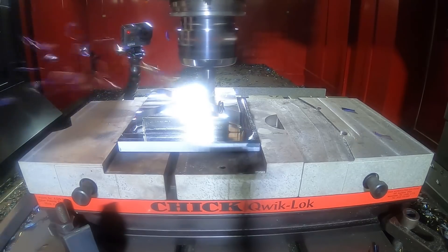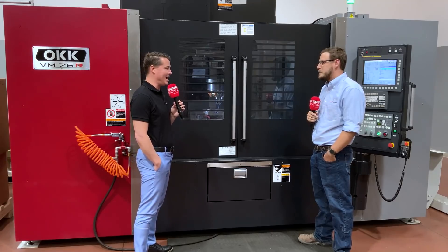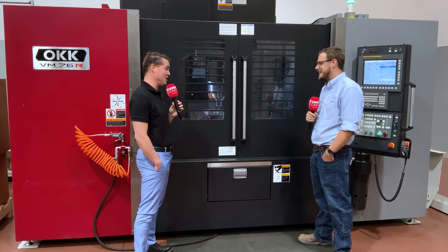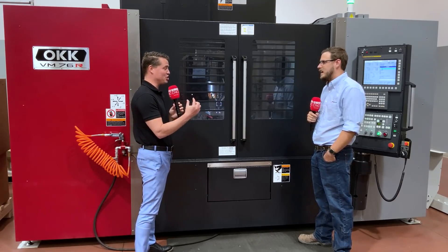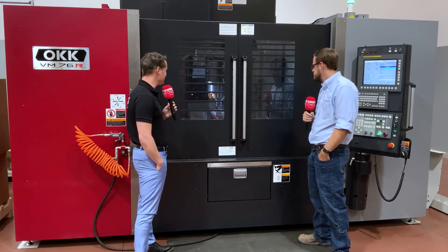You can see the chips turning blue-gold right off the end mill and turning blue as they fly through the air. I was always taught that C's and 9's are the kind of chip you want, but when cutting like this it's pretty much a straight, pointy, prickly porcupine. You're looking at the color more than anything — that's right.